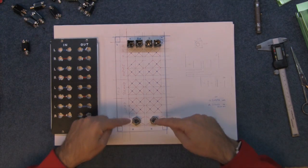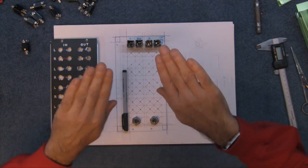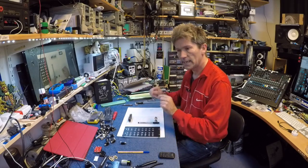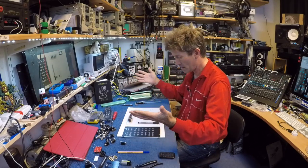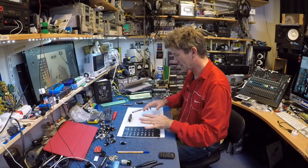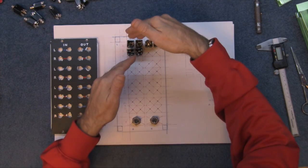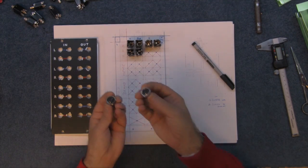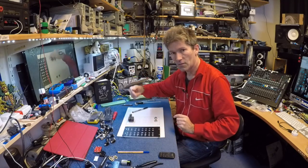So I'm going to remake this with a ready-made anodised aluminium panel. This is the design I've worked out — there's wood behind this area, and then you've got to add the bit for the folds. Another suggestion in the comments was why not put a MIDI in and out port, then I can connect to the back of any 19-inch rack unit. So I've redesigned with enough space for all these jack sockets — one set of ins and outs, left and right, for each of the four 19-inch rack units, and a little gap at the bottom for MIDI in and MIDI out. That will daisy chain along the back of the 19-inch rack units.